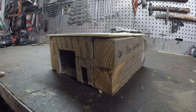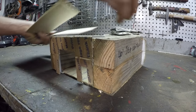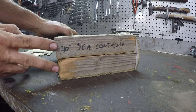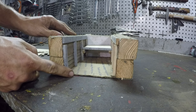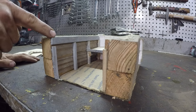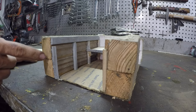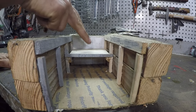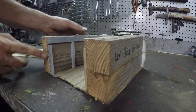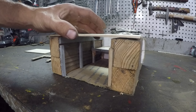This is the model I built to show the engineer what I wanted to build out of shipping containers. It's pretty crude, but it does the job. It's got two 40-foot containers stacked on top of each other, spaced out 24 inches apart. There's a framework of steel I-beams — I think this was a W18 by 46 — and 6 by 6 square tubing with quarter-inch wall. It shows the loft area, which uses spancrete panels for the floor. The back wall and front wall are block, and the spancrete panels go on the roof.